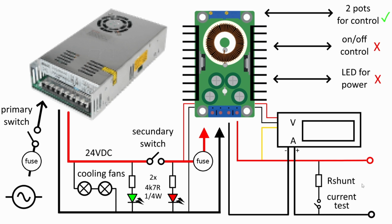And to test the maximum current, because the maximum current here is an analog magnitude, there's an analog value in this analog circuit right here, so you cannot externalize the maximum current. It's an analog setup. I got here a resistor to work as a shunt to test what is the maximum current allowed by the converter. So I have a button here, a power button by the way, that handles a lot of current, and I press it and I can adjust the maximum current the circuit will operate at without using the circuit as a shunt. This is really important.